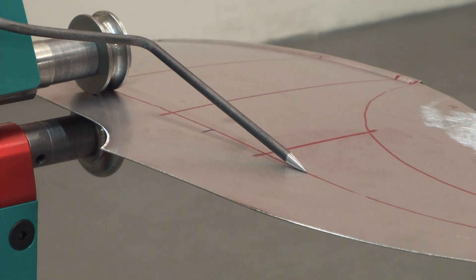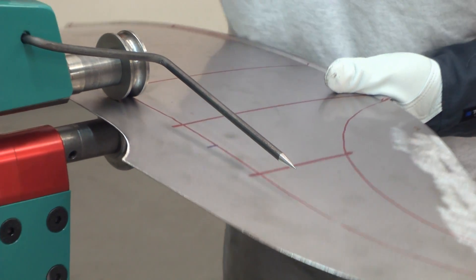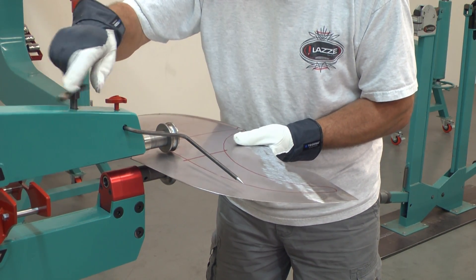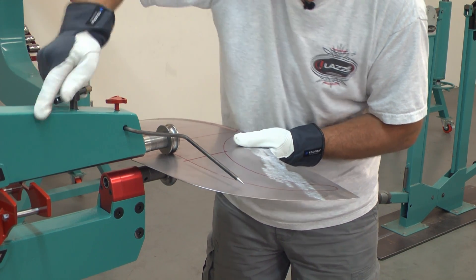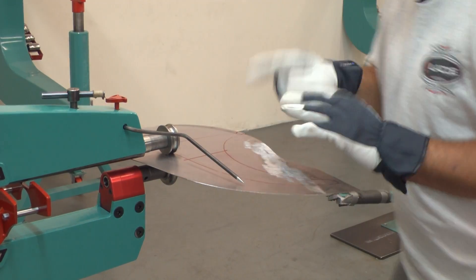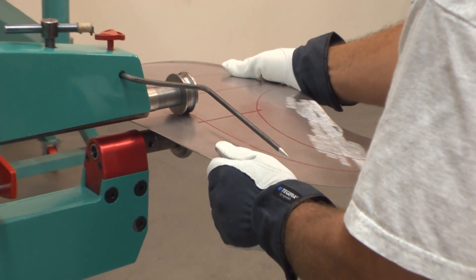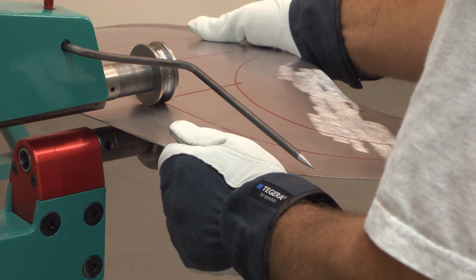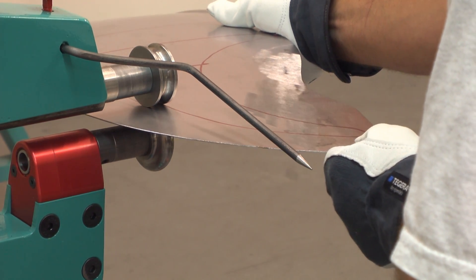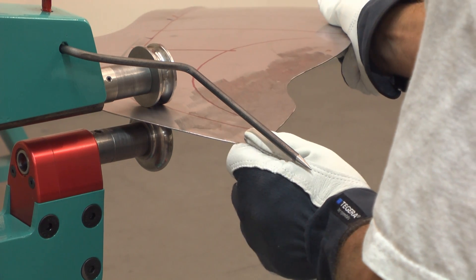Now I'm going into the curve with the point and I don't want that, so I need to go straight here until I have that blue mark in the center of the die. Then one, two, three — and I jump over to that part and turn this down again. That was one, that was two, and here is three.